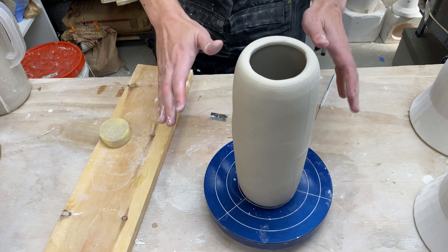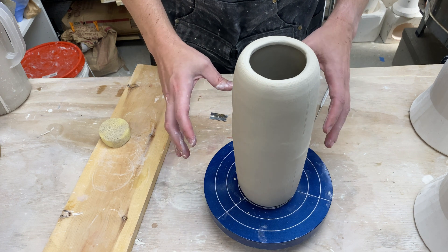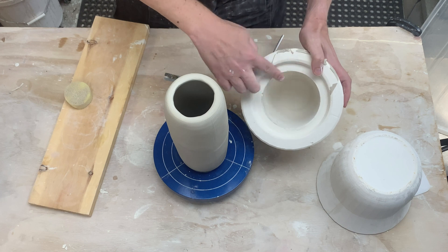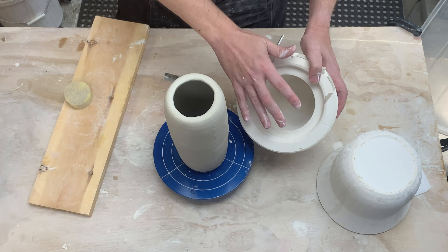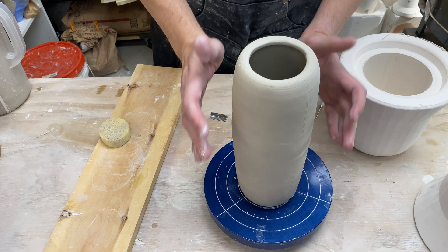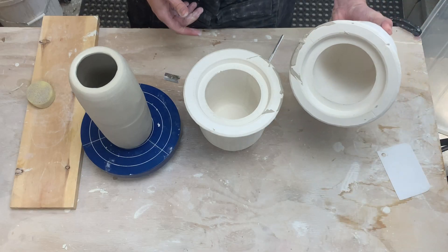I think maybe now you can see the taper a little more — it's narrower here, fatter in the middle, and narrower at the top again. Clearly this isn't really a two-part mold — we have two pieces and we just attach them together. However, this idea you can go ahead and use with ShapeCast right now. The top and bottom here are symmetrical, but you don't actually need to do that. The only thing that really matters is the diameter needs to be the same. So if we go back to our molds, it's these faces here that are going to mate — you could actually go and design two different shapes as long as they're all one-piece molds. If they have the same diameter, you can use this trick and join them together — the top and bottom can be different shapes or sizes. However, joining together the clay is a little bit annoying, and part of the reason I do slip casting is for the molds to do the work for me.